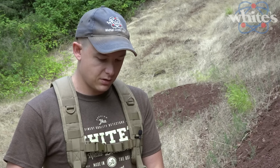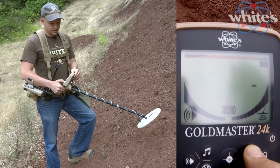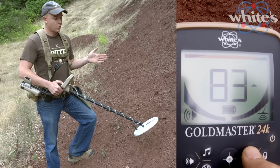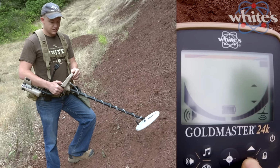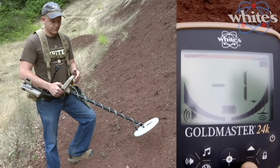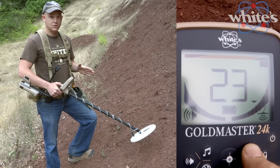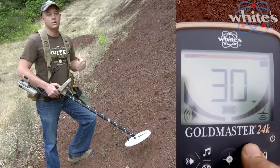In this ground scan mode, you can adjust your ground offset by hitting the up or down arrows. I learned this on the GMT, to get more sensitivity on nuggets, or to lower the sensitivity to hot rocks, depending on where they are related to your ground point. So you can see I've got a solid up arrow right now. It also tells you the number of offset. So right there I'm +1, there I am 0, which is perfect balance. There is -1. When you set this ground offset, this is active whether you are in automatic ground balance XGB or locked. So it'll actually track the ground but be +1 or -1 or whatever you set it to.